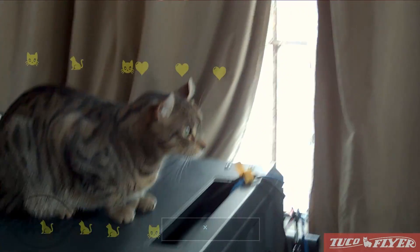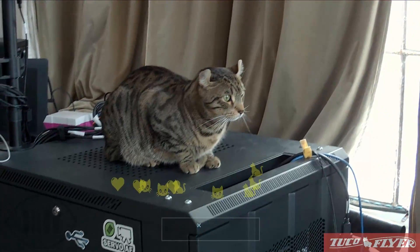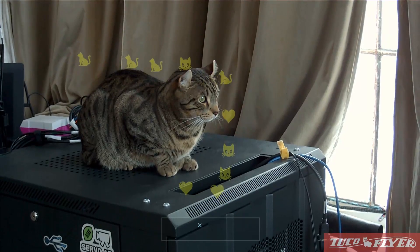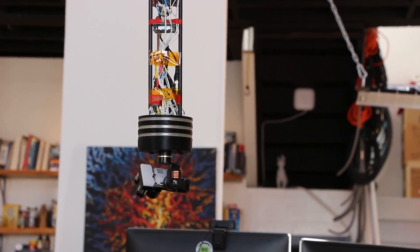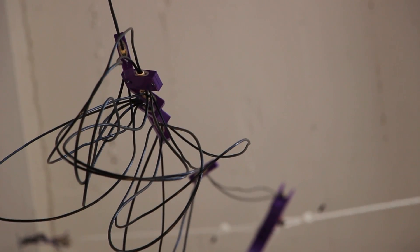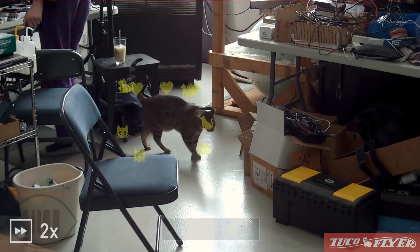In this specific case of keeping the tension balanced, I'm sure I could improve the behavior by tuning parameters, but ultimately the algorithms need improvement also. The rough position and orientation estimate is necessary in order to know how much cord motion corresponds to the desired 3D motion. I also want to somehow anticipate the tension limits by looking at the rate of tension change, so the correction I apply can happen gradually and not all at the last possible moment. I want to keep this video from getting too long, but I'll be releasing separate videos on robot components like the leash and the software stack, so be sure to subscribe if you're interested. I'll finish this up with some footage from the flyer as I follow Tuco around the shop, and I'll describe some of the problems we run into along the way.